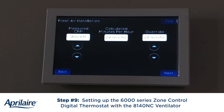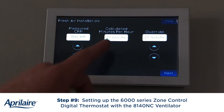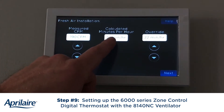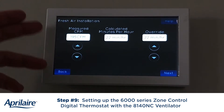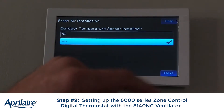With the measured CFM, the control — whether it's this control or the 8120X — looks at the number of bedrooms, plus the square footage, plus the CFM being measured, and calculates the minutes per hour. As I adjust the CFMs, my time also changes. We measured 190 CFM downstairs, so with that calculation, it's going to tell me that I need to run 22 minutes per hour to meet the ASHRAE standard. Going up to 195 CFM didn't even change my time. Once I've got that set, I go on to next.